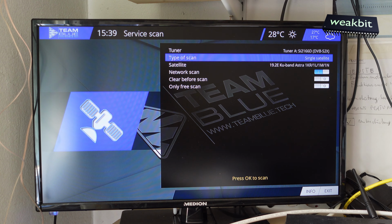Nobody has 4K. I mean, a handful have 4K signaling, and otherwise it's HD at 720 lines. But the PAL system has 625 lines. Not all viewable, yes, but from the bandwidth perspective, 625 lines must be broadcast over the satellite permanently. Now we have 720 in nearly all HD transmissions, but this is only 95 lines more. Only 576 are viewable, and now you have 720.